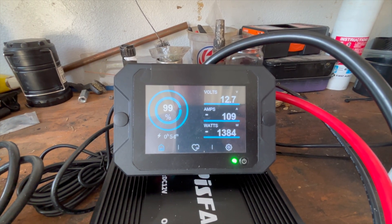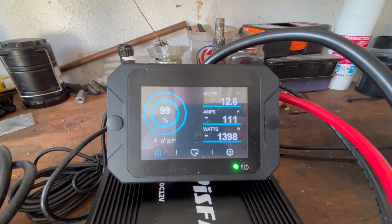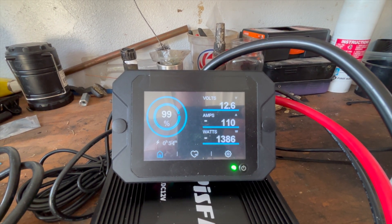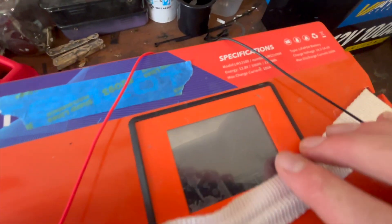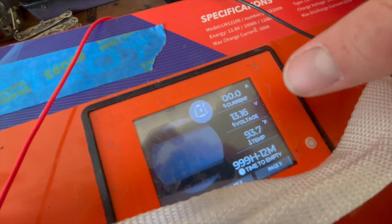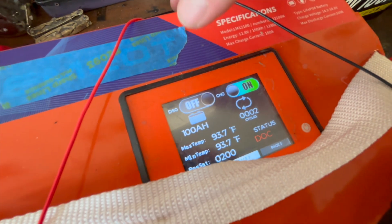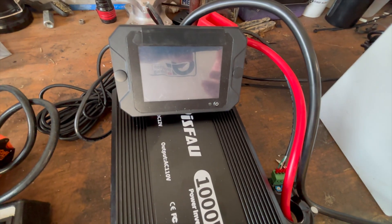The inverter can't quite get out the full draw. We're holding 110 amps - and there it goes! That's what it's supposed to do. It went to standby - discharge off. It kicked back off, telling itself it's too hot. That's what it should have been doing.